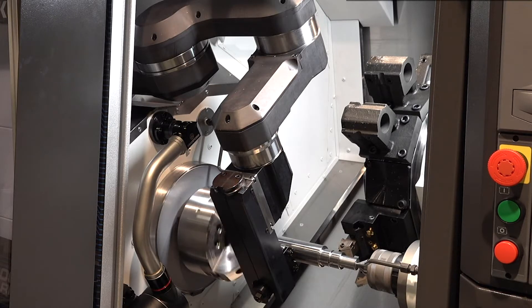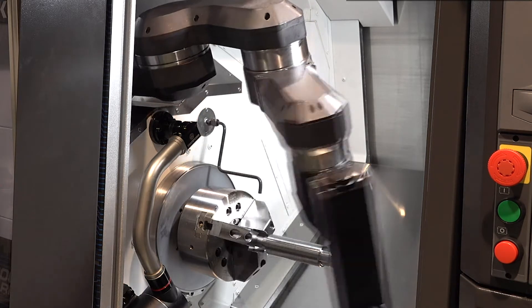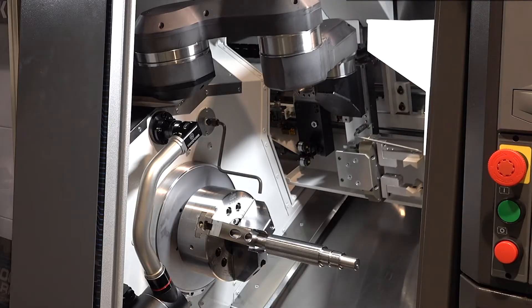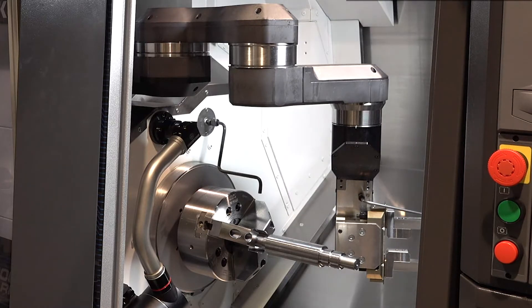The other accessory looks like either a steady rest or a steady roller — what is that? It's a roller we can use as a work support. With a long slender shaft you would normally want a steady rest, but in this case, because the Armroid is dedicated for shaft work, we know we might have shafts with unfavorable length-to-diameter ratios that need extra support. So we can use the robot while it's not busy changing parts to help support the work piece and make a better quality part.